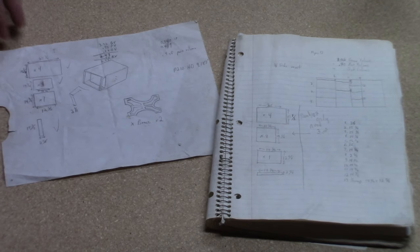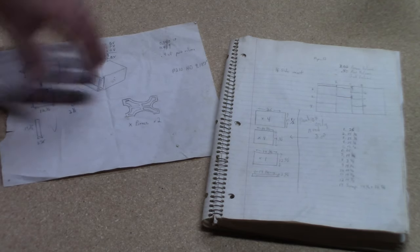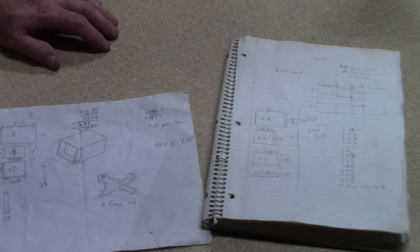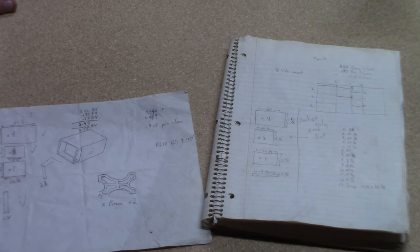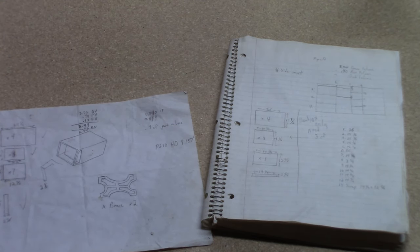The first thing you want to begin with whenever you're doing a speaker box design is to lay it out — lay your cuts out, your measurements, your airspace. It's harder to go into a box build without this information. I have here one of my old designs I used for a Mats Pro 12. This is a good box for high-caliber subs — anything with 750-plus RMS. Feel free to write these down; I don't normally give out my box dimensions, but let's do it.